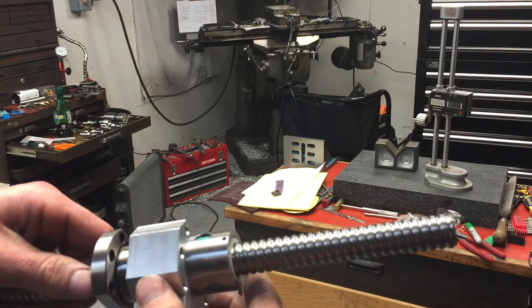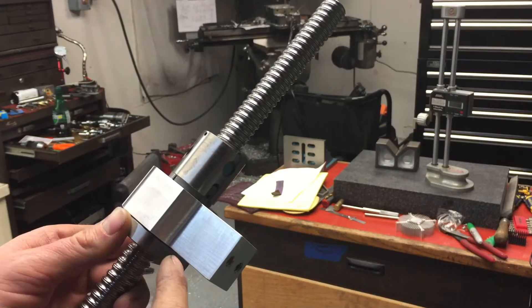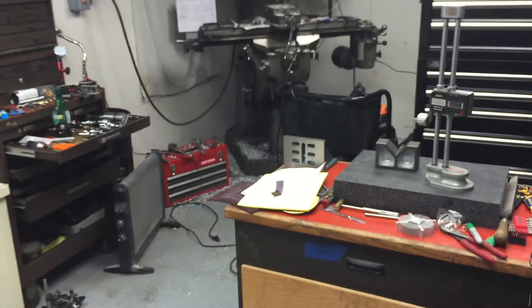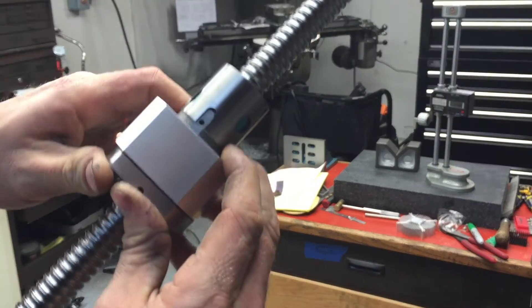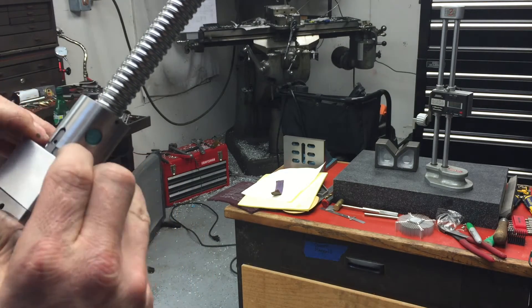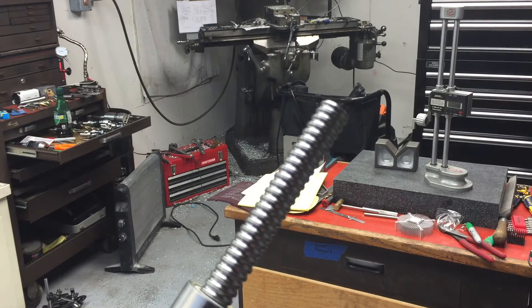But anyway, see how this guy fits. Now all of my ball nuts have been the same — they're looser here, and the actual diameter increases closer to this collar, or shoulder, whatever you want to call that. So that's been kind of interesting. At first you go to fit the thing on there and it goes right on, and then you'll end up having to bore again if you don't double check that measurement. I don't know if it was just my batch or what.